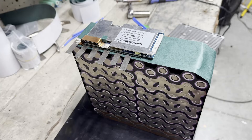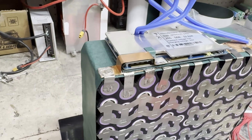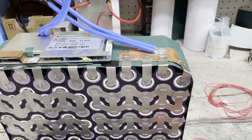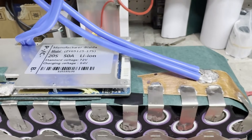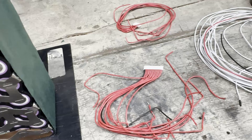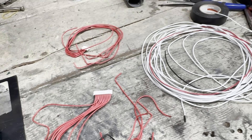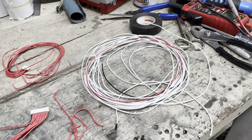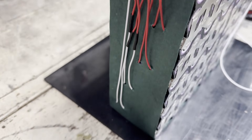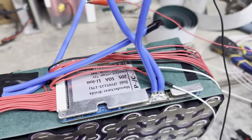The copper spot welded on the bottom of the pack is only 0.15mm, while this copper up here is 0.5mm — a lot thicker — so I don't need nearly as wide a piece to carry the same current. It's time for the balance wires. I had to extend them a bit since they were used, but they turned out to be pretty easy to do.